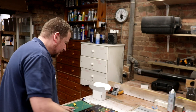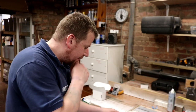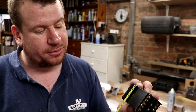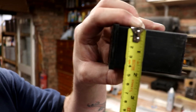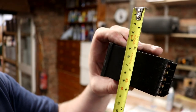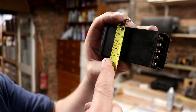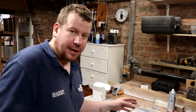So I'm not worried - I've done what can only be called a tremendous save. What I suspect happened is that instead of using the calipers to get a measurement, I just put the tape measure on the PIDs and it says 44 millimetres. Probably what I did to take any discrepancy out of the end of the tape was start from 10 centimetres, and then read it off as 54, and then forgot to subtract the 10 again when putting it into Inkscape.